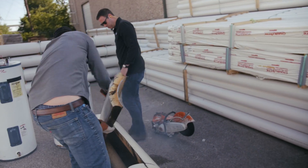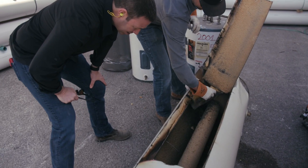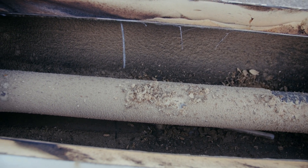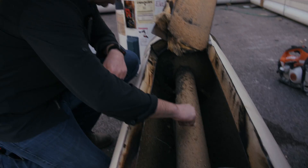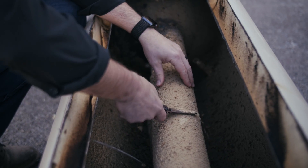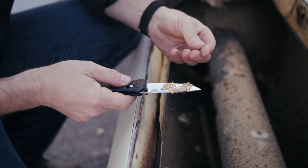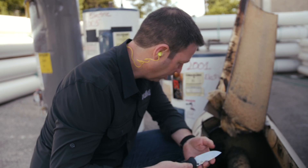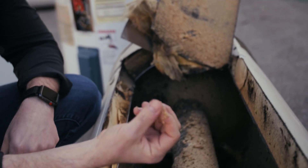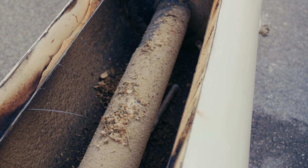Nice, Jordan. Well done, my man. Just flap it back — that's fine. Very interesting. Look at that scale. What we've got here is scale from the hot water building up on the whole inside of the tank. Let's see if we can flake some of this off. Look at that right there — it looks like sand, but what you're seeing is mineral deposits from the water depositing on the outside surfaces of this water heater. On the tank walls, on the flue, and probably pretty heavily in the bottom of the tank.